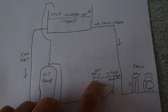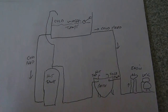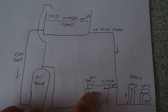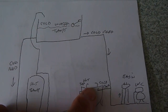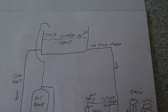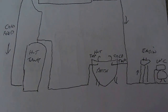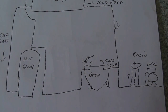To check whether your cold tap is off the tank or off the mains, open the bath tap and see if you can put your hand over the end of it. If you can stop the flow with your hand, you know it's off the tank. If it keeps forcing by and you can't stop it, you're off the mains. But even if it is off the mains, you could still be running the mains and hot simultaneously fast enough that the ball cock can't keep the tank full. So if that's happened after a bath, run the hot one first and cool it down with cold — or if you've got children, run the cold first for safety and then add the hot.